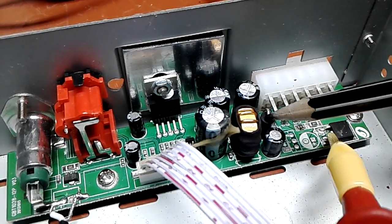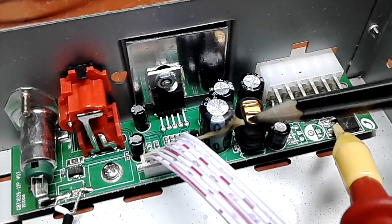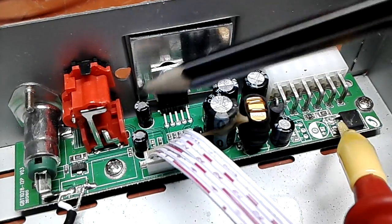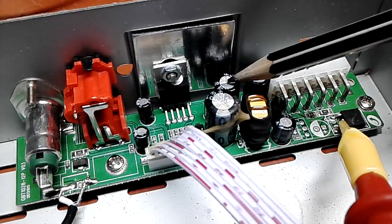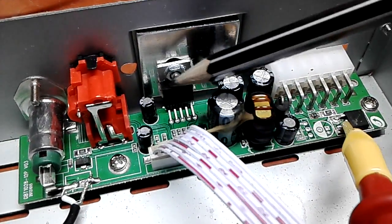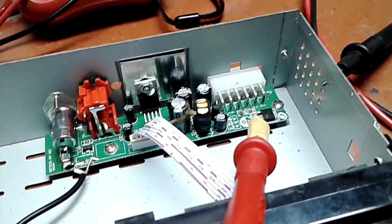That's your polarity protection diode. That's some decoupling capacitor, I don't know where it is. That's a filter choke. And that's your main filtering capacitor. And some bypass caps, or maybe coupling caps to the RCA jacks, I don't know. But these two look suspiciously like the output capacitors. They are the same value, and they are suspiciously close to the chip and to the output. So let me do just that, and we will test each and every channel.